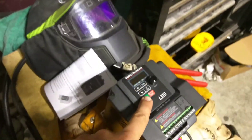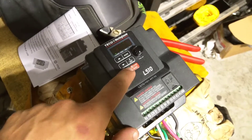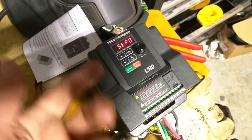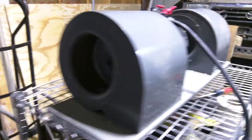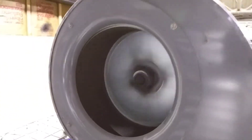Then you've got that big fat 10-gauge cable going over to your VFD. I've got the parameters set, so I'm not going to show you that. Turn the VFD on with the run button — since I've got the dial turned all the way down, it's at zero. It says stop. Let's turn that up a little bit, and we've got some turning going on. Kind of hard to see — oh, there you go, see, it's turning.